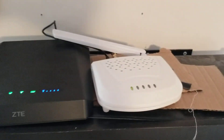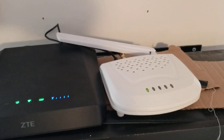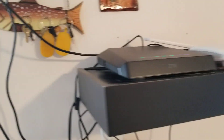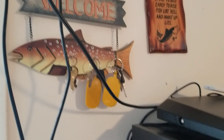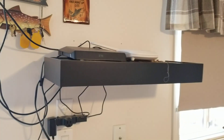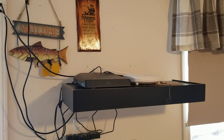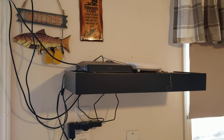I have a cellular booster — an Amazon cellular booster — and I leave the antenna right over top of the router so it's very close. I also have an Ethernet cable running down to the other camp and an access point. I'll explain on paper why the omni-directional antenna, with much lower gain at 9 dBi, works as well as it does.